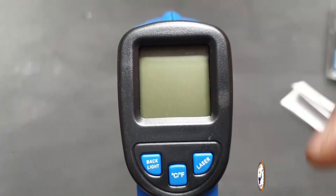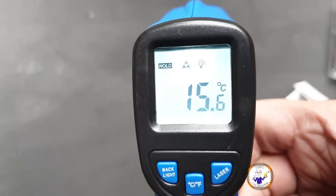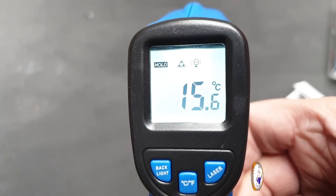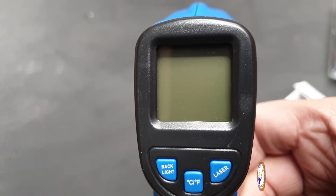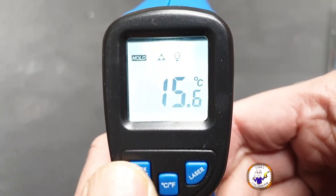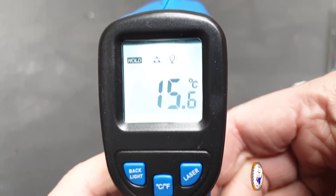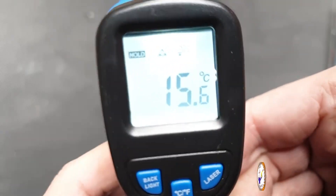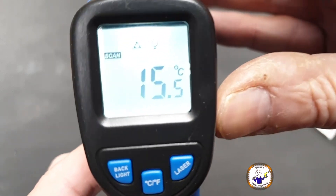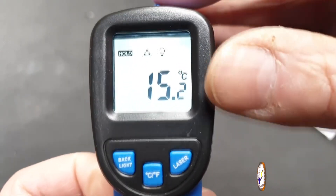To actually use it: with the battery in you have a blank screen, but as soon as you pull the trigger the screen comes alive. It stays on for just over 10 seconds then goes off on its own, so you won't get a flat battery if you put it back in your toolbox. The backlight button does what it says. Where it says 'Hold', it's showing you the static number won't change regardless of what you're pointing at. Pull the trigger and it goes to 'Scan', giving you a live reading. Let go and it goes back to 'Hold', staying on screen until it times out.